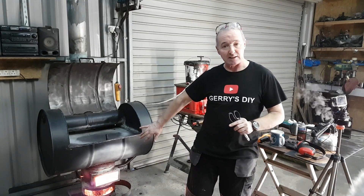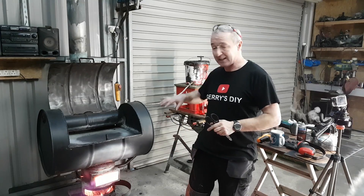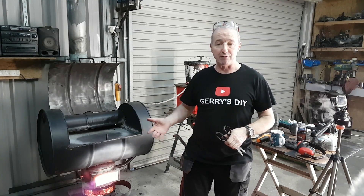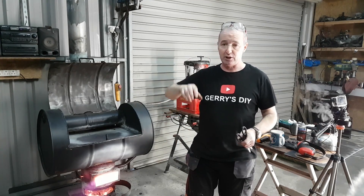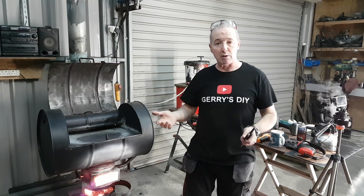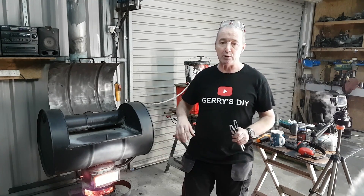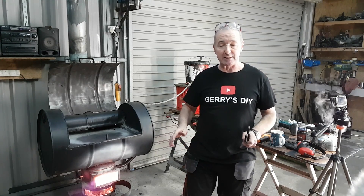You can see the flame — it's white, no smoke whatsoever outside, and absolutely a ton of heat. That's my old burner, my new burner works better. I can't say it's more efficient — they're both running about two litres an hour. But you can turn it up if you want more heat, you just dial it up. The problem is there's a range at which it doesn't smoke — if you put too much oil in and flood it, it'll try and burn it but won't burn it efficiently. These things are said to burn two to three litres an hour with no smoke once they get hot.